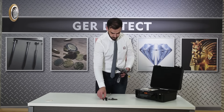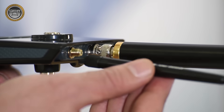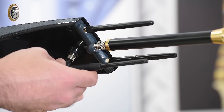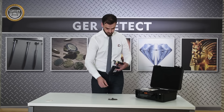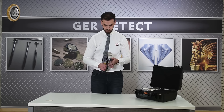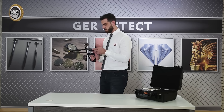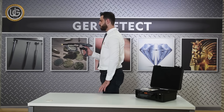Install the small antenna, which is specialized in receiving the signal emitted by small targets. Install the receiver dish for reference, then open the foldable device screen. Increase the length of the antenna to raise the front-sense range of the device up to 3,000 meters. After completing the installation of all parts, the device is ready for use.